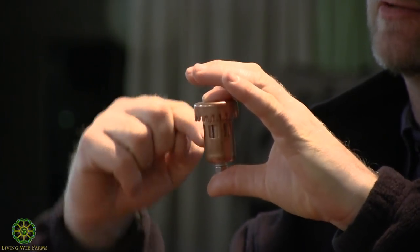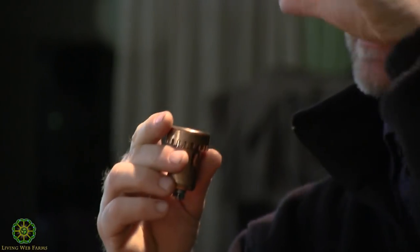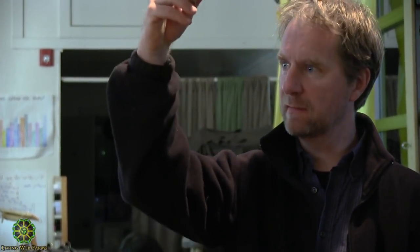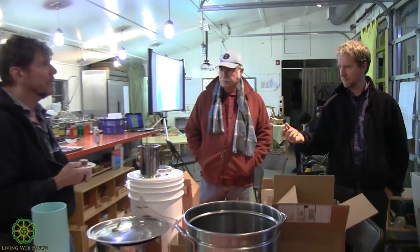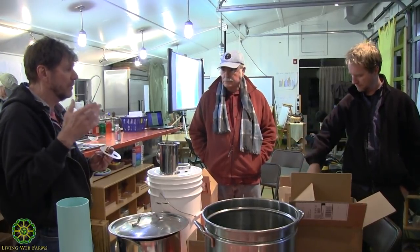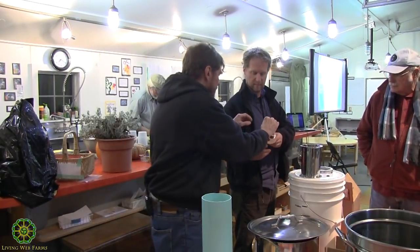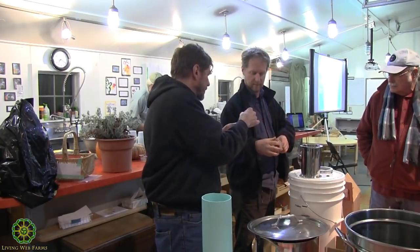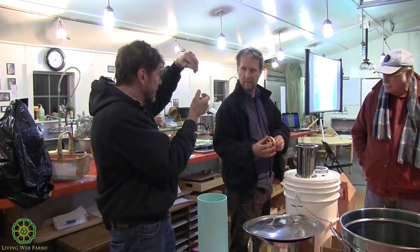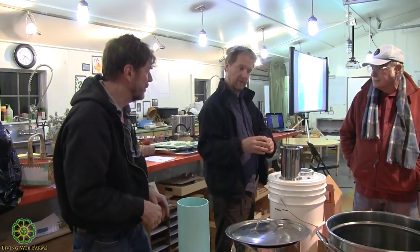To get up, the gases have to go through these holes, down through what looks like a pool of water, and then up that tube into the next stage — it actually circulates in a circuitous path. It's a means of using both the physical passages and the action of going through water that makes the separation. Those diverters can be bent and adjusted to control the direction and angle of where the water drips down onto the next step.